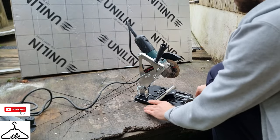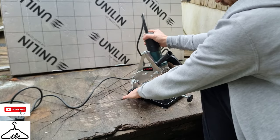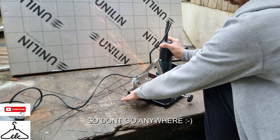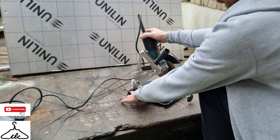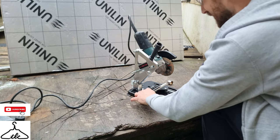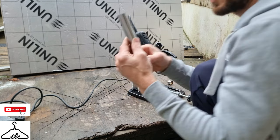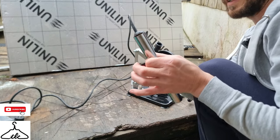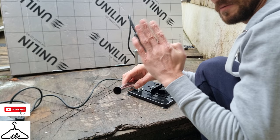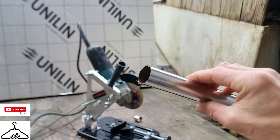So this is the first cut I've done with it — I haven't tested it at all. Anything goes wrong, it'll be on camera. Let's give it a go. How awesome is that? It's got sparks. It's not a chop saw, it's a cutoff saw, so there's going to be sparks flying around. But it's not square whatsoever — I need to set that up. But it's pretty crisp and it's straight. When you're grinding these by hand, you can get bends in it and the blade starts binding halfway through. Let me get a close-up — there's the cut. Pretty good overall.